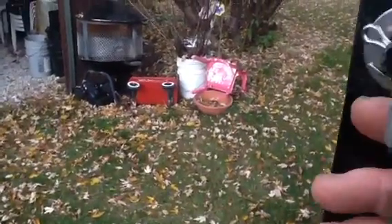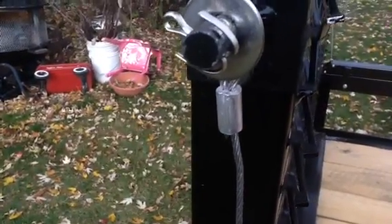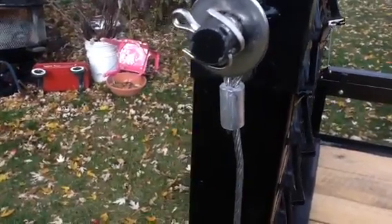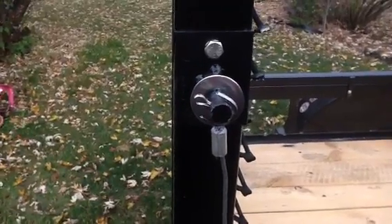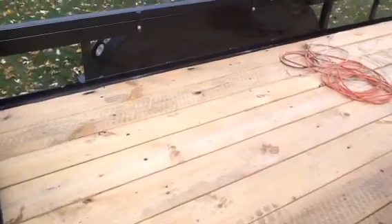These are nice cables with a ferrule — garage door cables. They come 17 feet, and I lopped off a piece. I used the loop, the tension relief loop that goes around the end of the spring. This is a 3/16ths inch cable, and a 3/16ths U-bolt — a cable bolt is probably the best way to describe it.